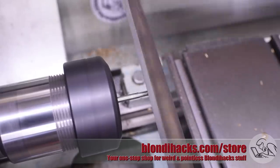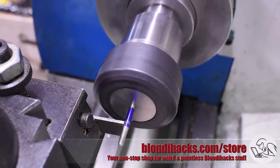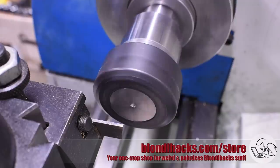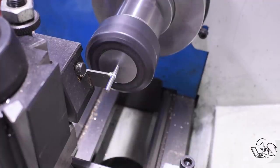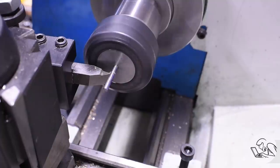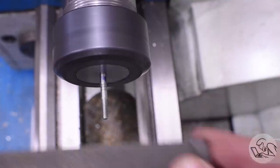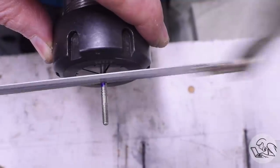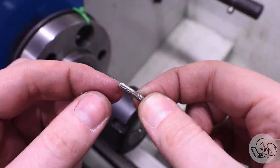I'll round off the end nicely, and then I want to put some grooves below the threads to act as a key for the epoxy — it's going to get epoxied into the base. So I'll come in with the parting tool — and yeah, stick out caused the stock to flex, which caused it to work harden, which caused it to snap off. I'll try that one more time, working very close to the collet, and snap. Plan C: coming in with a sharp nose tool this time instead of the parting blade, making a different style of groove — and that worked okay. Then I put the threads on second just in case the stud broke again, and then I cut it off with a hacksaw rather than trying to part it off. That seemed to work okay, but it was a lot of effort.